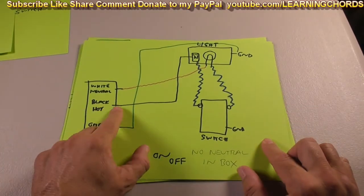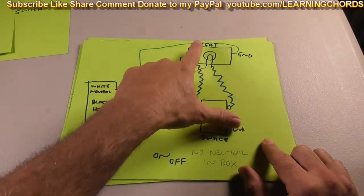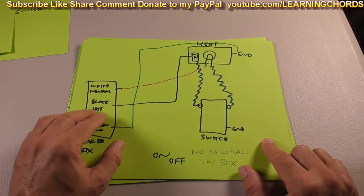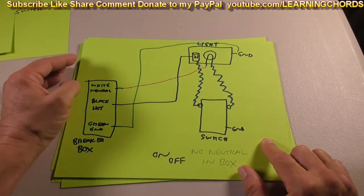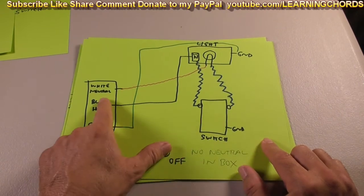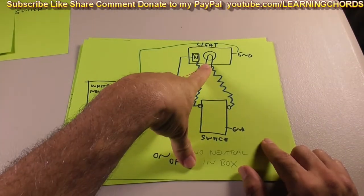Okay, so what you have here is the neutral wired straight over to the light. Say, for example, upstairs somebody threw a light bulb in there, they put power, they had a light. And then one day somebody said, I want to control this with a switch. And so they go down and throw a switch downstairs, and they did not connect the neutral down into the box because the neutral was already connected to the light.